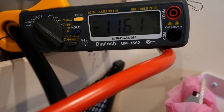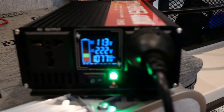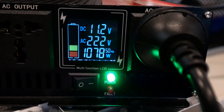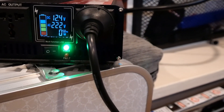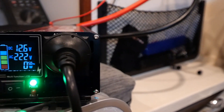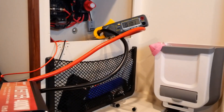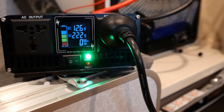I've now pushed the button on the coffee machine and you can see 116 amps flowing through our DC cable to the inverter. The battery voltage dropped to 11 volts on one reading, but my multimeter says 11.8 volts. The coffee machine was running its heater element. The current flow has now dropped down to 10 amps again on our clamp-on meter and the battery voltage has gone back up to 12.6 volts, so we're back in standby mode.